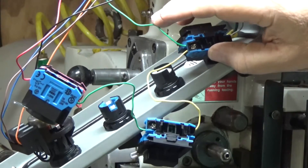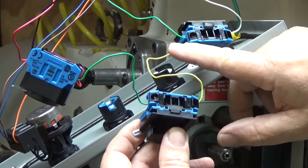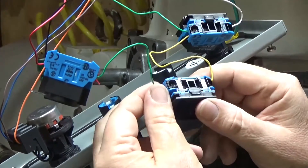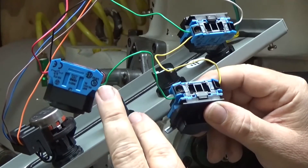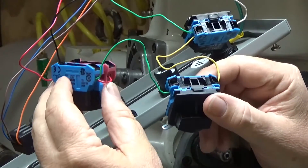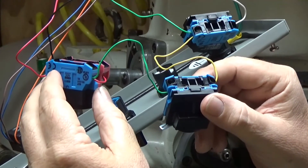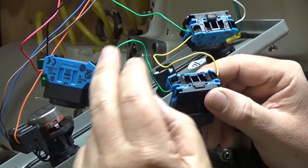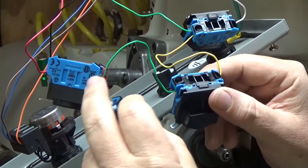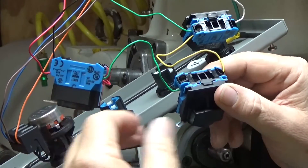Out of the X1 I've got the common, or CM wire. From the same terminal, I've got the CM common running over to the start button. From the start button I've got a wire going to one side of the forward/reverse. On the forward/reverse I've got a jumper that makes a common — in an earlier video you saw this hooked up to a drum switch, which was very simple.